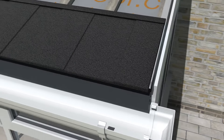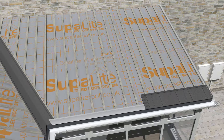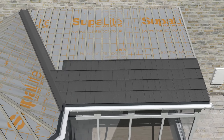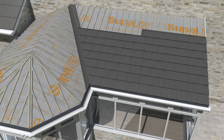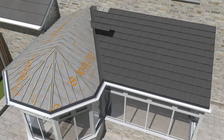At this point of the roof installation the tiles can now be fitted. You must ensure that the first tile is positioned and secured over the soaker. The first row of tiles lock into the starter cleat and all remaining tiles are installed from right to left to ensure they interlock correctly. If there are any issues with the size of a tile, these can be cut to size with Superlite nibblers or a grinder.